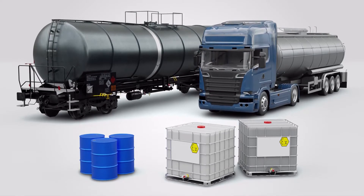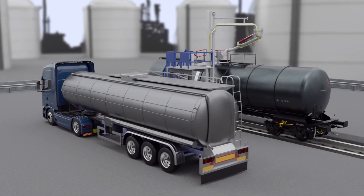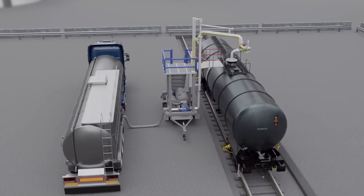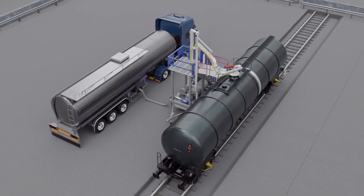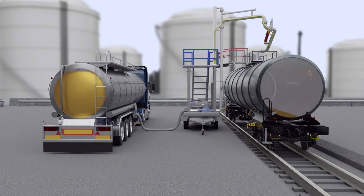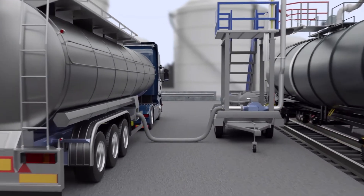Let's take a look at a few key applications. Transferring hazardous products from road tankers and tank trucks to rail cars using mobile transloaders provides an ever-present risk of static accumulation when reliable grounding is not in place. Static electricity is generated by the movement of product through process equipment such as hoses and pipework. If an electrically insulating product is pumped from a road tanker or tank truck through the transloader into the rail car, contact between the product and the interconnected equipment will cause electrostatic charges to be generated.